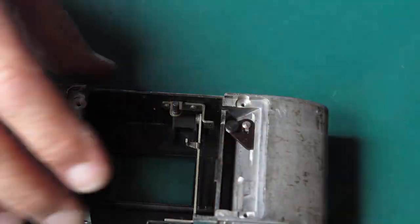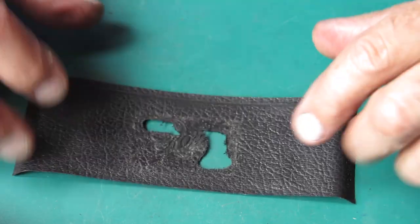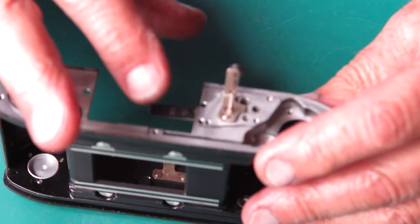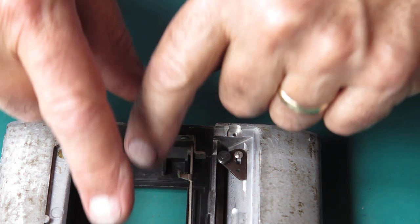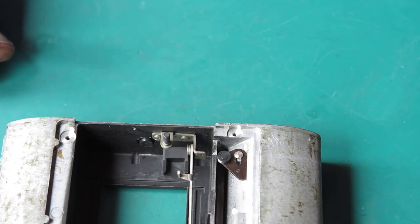The leatherette did come off the parts door fairly readily. I'll flatten this out and then use it to cut some discs — there are spares for the center of advance levers like that, but not for this camera. I think we can put in the rangefinder coupling parts next.